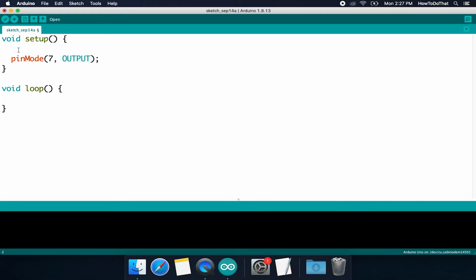The reason that I personally recommend that you have that line is because it really helps you understand your own code, either while you're debugging it or writing it, or if you come back to it months from now. You will be able to see, oh, these pins are supposed to be input pins, they're supposed to be output pins, instead of trying to search through your code and figure out based on context. So I highly recommend to declare not just your outputs, but also your inputs.